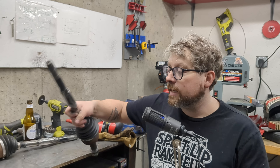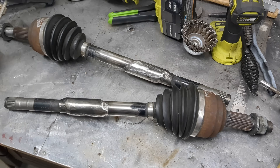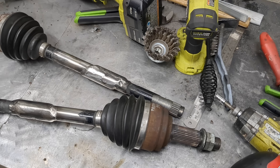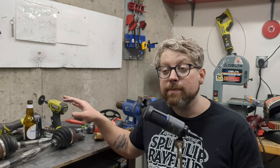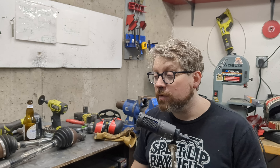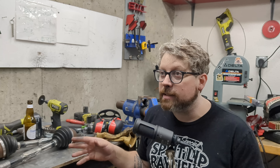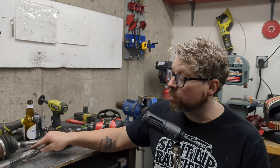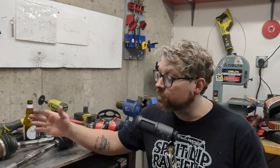Just like that, I have some bomb-proof CV axles that are 3-1/2 inches shorter than stock. You can't just go to a catalog and order CV axles for a Nissan LEAF that are 3-1/2 inches shorter — the only other option would be to get a custom shaft made, which would be $500 to $1,000. Admittedly this method is a lot more labor-intensive than just butting them up and welding, and maybe that would have worked fine — I'm not a welder. But I know this will work, and viewers who want to try this can just use a MIG welder. I chose to use a stick welder.